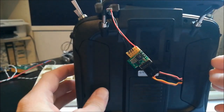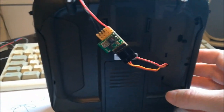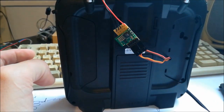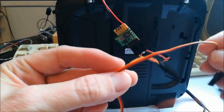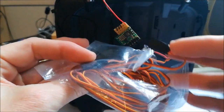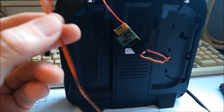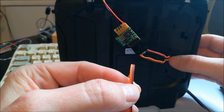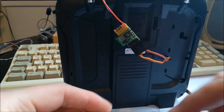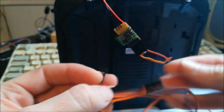So from the outside you can see the three wires for the UART port — RX, TX, and ground — and the two power wires. I didn't want to drill holes, so I routed them through an existing hole. The hardware you need for this modification is just servo wires — the thin ones, not the thicker ones, so you can get them through the hole. I buy them from HobbyKing; a pack is maybe five dollars. You need sufficient length, but that's really all the hardware required.